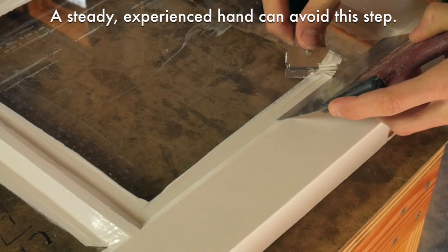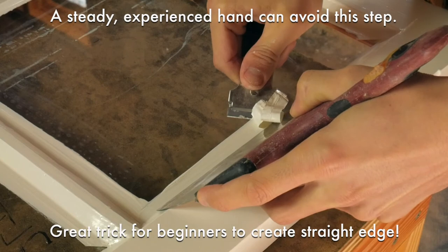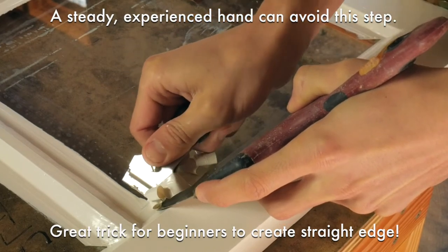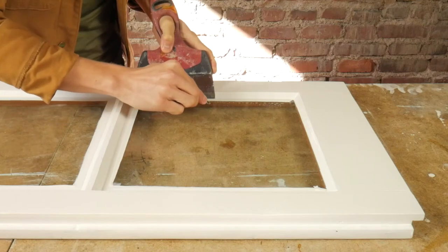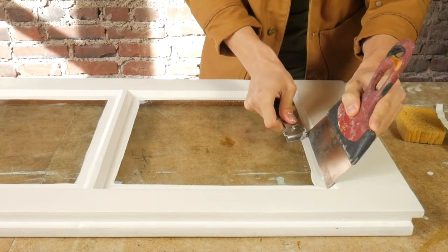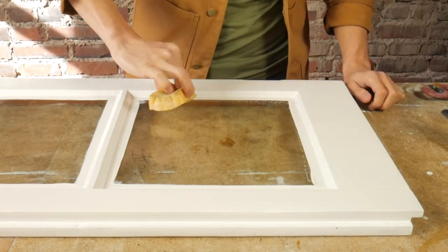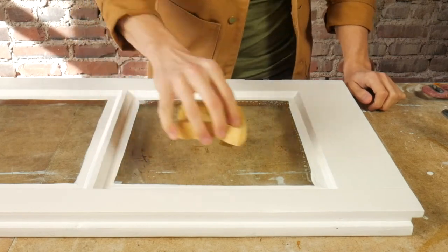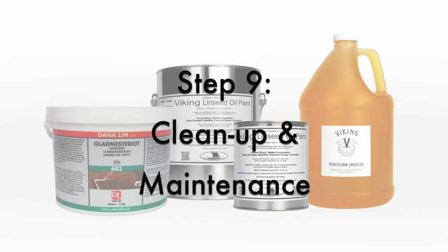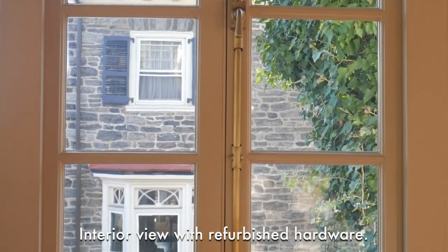Trim paint back once dry if needed. Be sure to let Viking linseed oil paint dry completely before trimming, as paint could smear, ruining the work you may have already done. Use a sharp glass scraper. It is possible to use a spackle knife to scrape or cut against for a nice straight line. It is also possible to apply some soapy water to the glass — it allows the blade to glide a little more smoothly. Clean hands and brushes with linseed oil soap, and clean glass with a non-petrochemical glass cleaner.